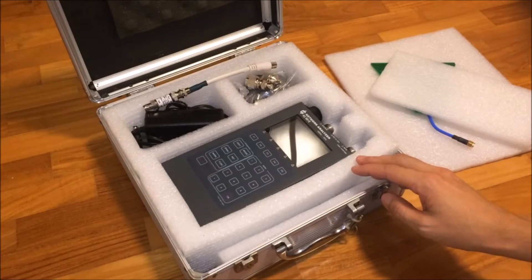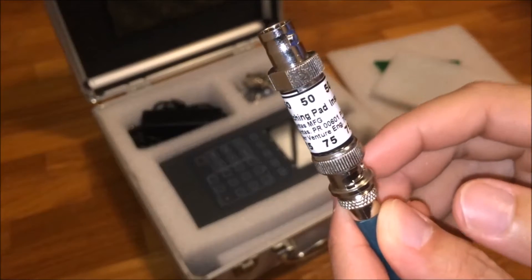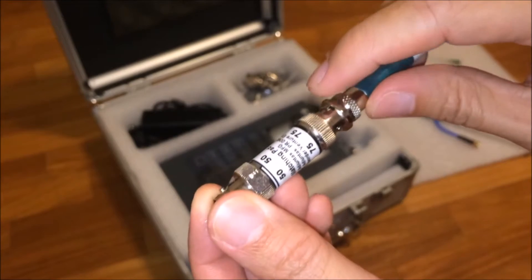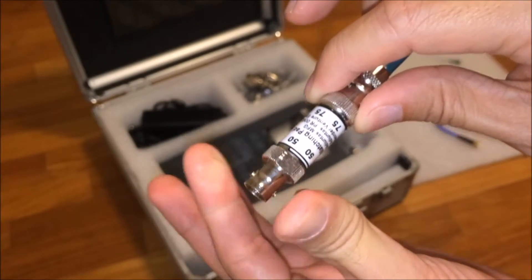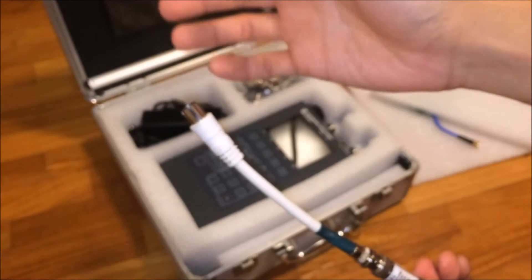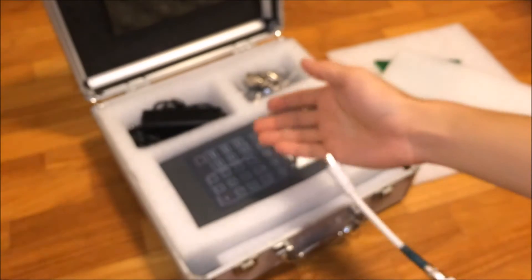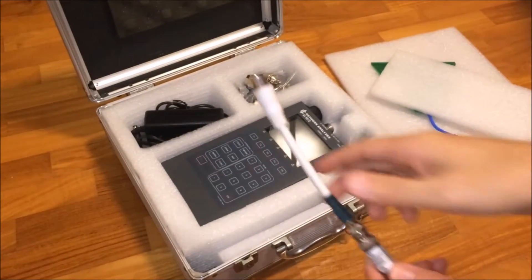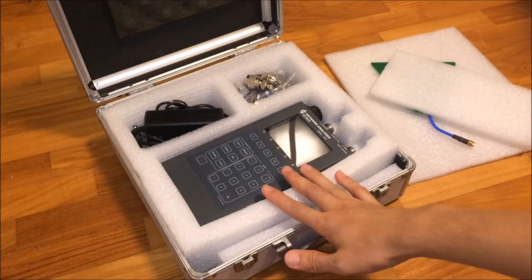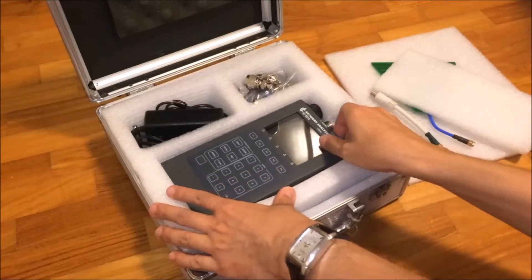What I'm going to show you today is this little gadget here — this is a matching pad. Basically what it does is it will convert the impedance from 75 ohms to 50 ohms, and that will allow me to hook up an HDTV antenna or TV antenna. As we all know, TV antennas are 75 ohms, so I would not be able to measure or tune a 75-ohm antenna with this analyzer. With this matching pad I will be able to use the 50-ohm analyzer to measure the VSWR of a 75-ohm antenna.